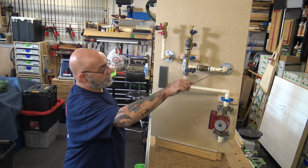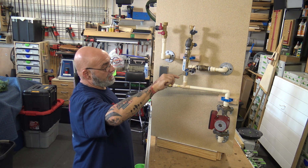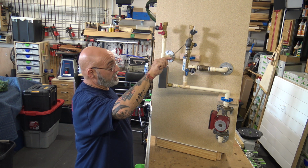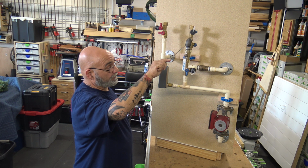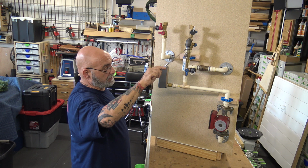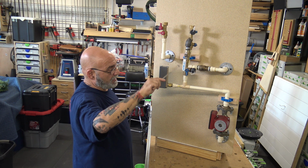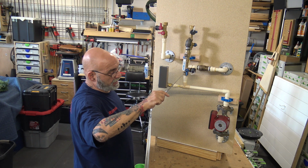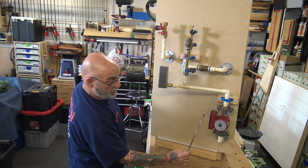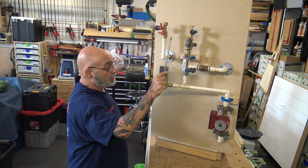So your cold water from the main, check valve, arrow in, up into it. You might have to put a T here with another check valve if you don't have the Rinnai dedicated return. To make it look pretty, you're going to need some brass fittings, brass nipples, a valve, then your check, which has your bleeder and your bleeder port. Then into it, your pump arrow going into, so remember, all arrows, pump arrow, check valve arrows, all of that.